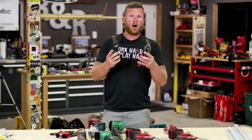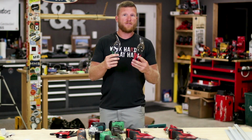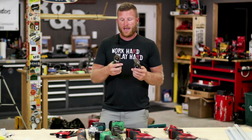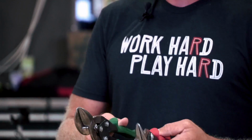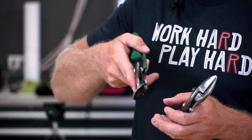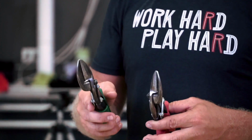What I like to use are offset snips. So these are like your typical aviation offset, and Midwest snips are probably my favorite. They always seem to be my go-to, and they're readily available at my local Menards, which I love. That's not a sponsored shout out. I like Menards. And what I like about these is the way that the head is offset and kind of cocked, you can get in and cut across a flat piece of steel without the steel getting in your way and marring up your surface while you're making your cut.